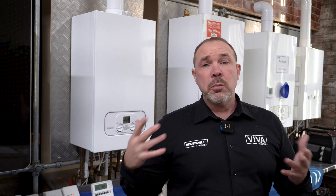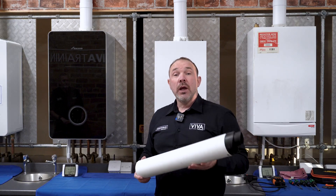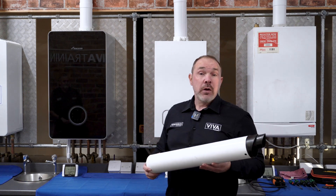When we're servicing a gas boiler, always remember your Regulation 26-9 checks, which covers the flue, the gas, and the safety of the boiler. When it comes to the flue, you check it according to the manufacturer's instructions.